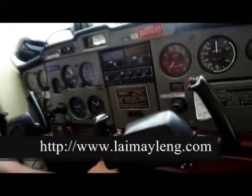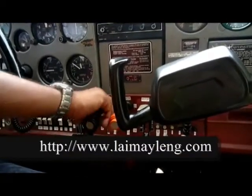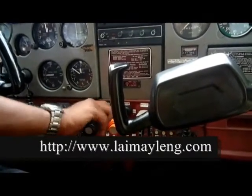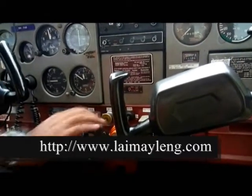Alright? This is your throttle. This is where you go. Full power, takeoff power. Complete idle. Now for initial start, you'll be 1/4 in, and this is a lock nut. Just to lock it in place. Alright? This is not like the commercial aircraft where they use the throttle levers, the power levers. Alright? This is our special power lever here.